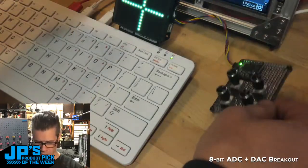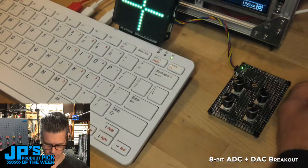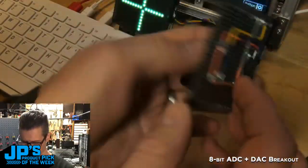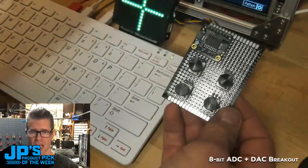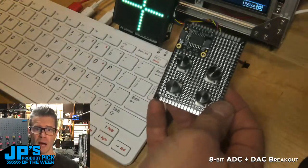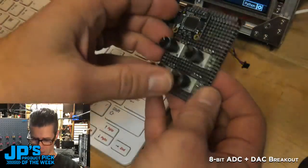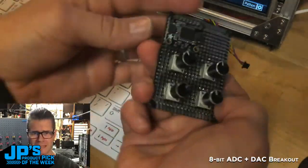And that's it. Now, one of the neat things about this, I'm going to go ahead and cancel that, stop that from running there. One of the neat things here is that we can unplug this board, and this is portable. This has no microcontroller associated with it. It has no particular single board computer associated with it. It's just I2C over these STEMMA QT connectors. So I can plug that into name your microcontroller if you have something that you want to add 4 analog ins to and that 1 analog out. This is it. This is very simple. You could even do a custom PCB for it if you wanted, but I thought keep it lean.